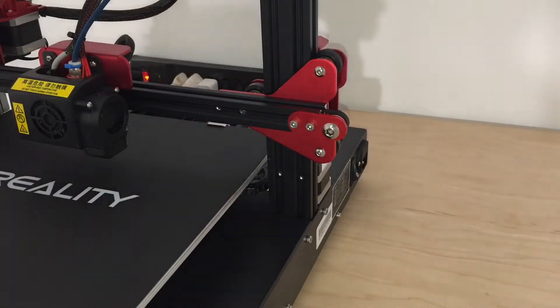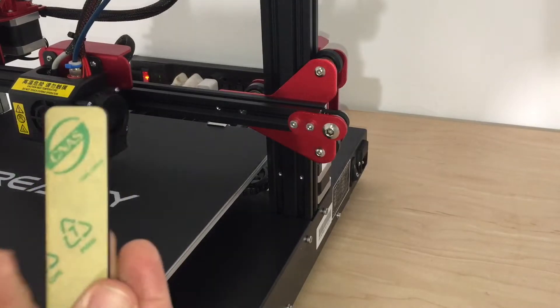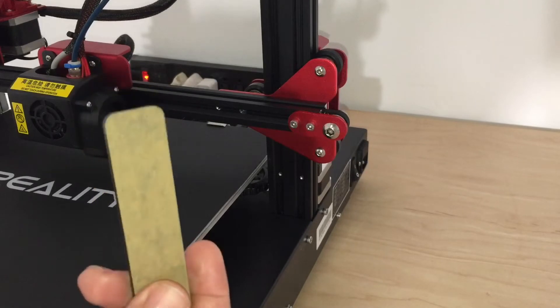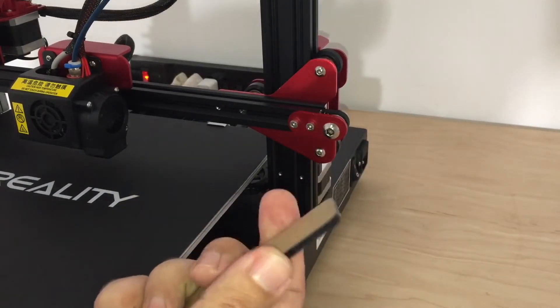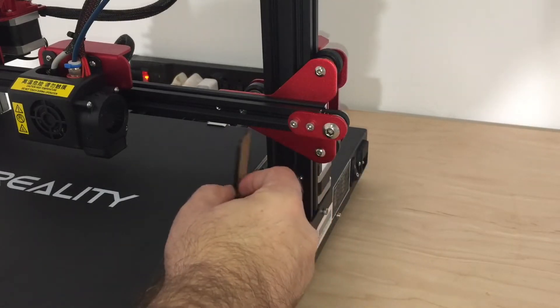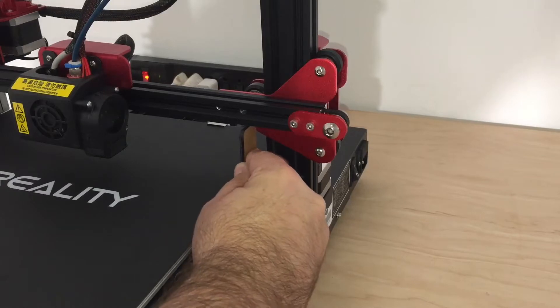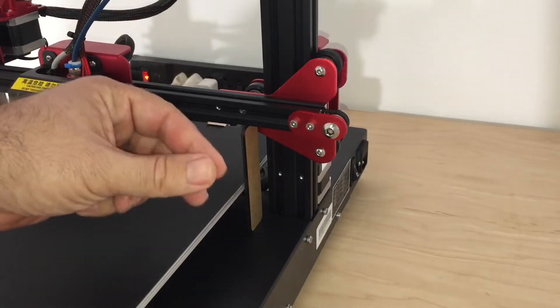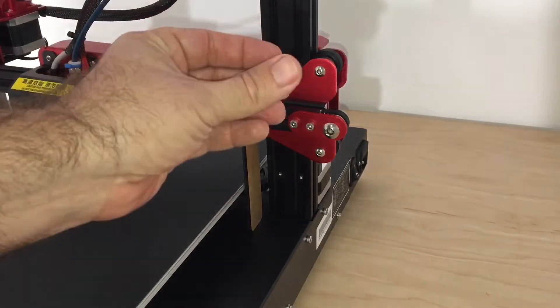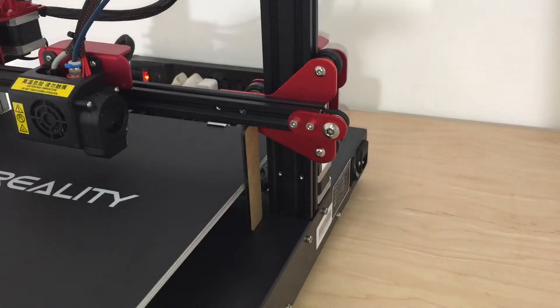I got it all installed. You want to make sure your bed is level — not only on this side but the other side too. They gave me this piece to make sure the x-axis is adjusted just right. It's a 100mm acrylic piece — you put it right against the bed first, then slide it underneath until it's tight. If you need to tighten or loosen it, you just turn the screw on the back by hand, which raises or lowers that side. You do that on both sides.